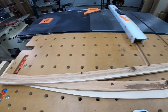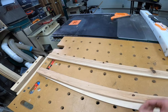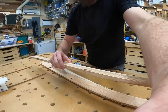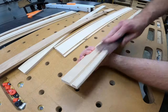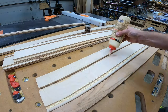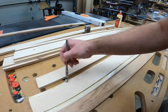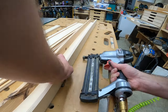20 minutes, that's it. Yeah, at times like this I realize how quick it is and how worthwhile it is to actually deal with hardwood instead of plywood. I love Baltic birch because it's there and it's easy and quick, but hickory — oh man, it's great. Starting to look like a shelf. Now since the top and bottom of this thing won't be visible, I'm going to use brad nails to hold this together while the glue dries instead of clamps.